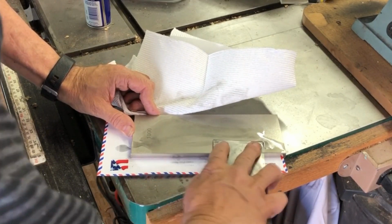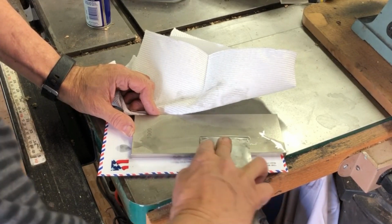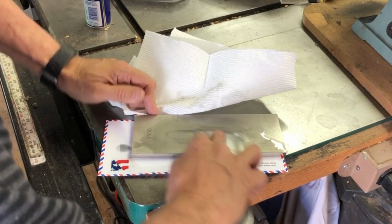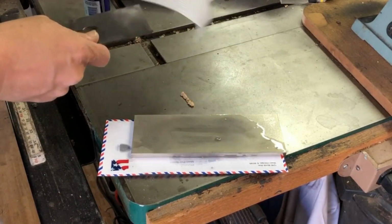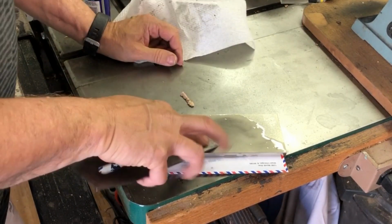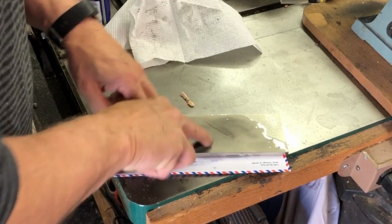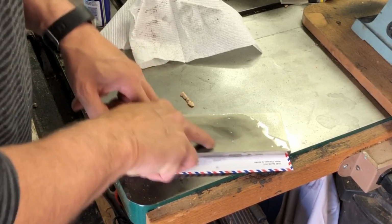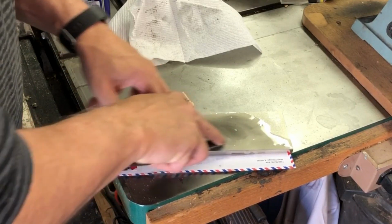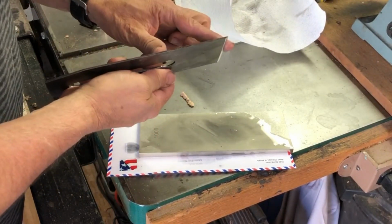I'm kind of using the Rob Cosman process here in order to get the back even a little bit more flat, and then raise it up slightly to get a micro bevel on the back side, and then I did the same on the primary bevel and the secondary bevel. So in order to test this, I very gently used my finger as well as some paper and went right through it.